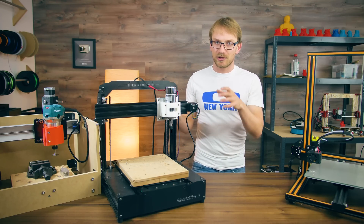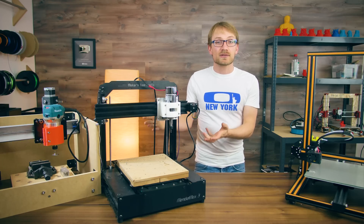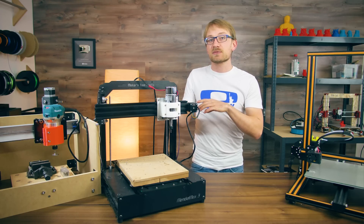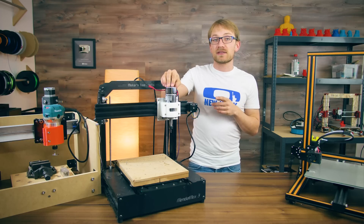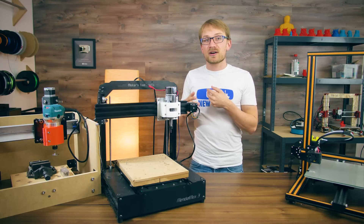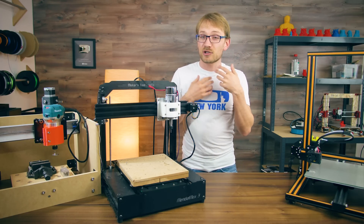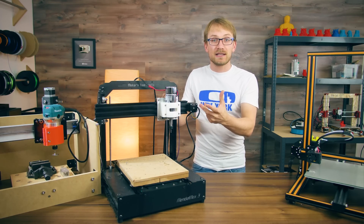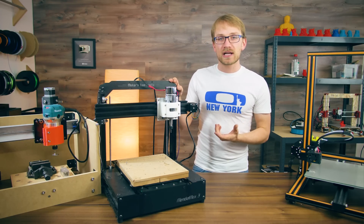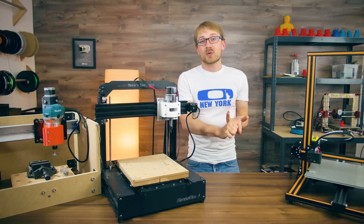Let's not forget that 3D printers originally did originate from larger CNC machines. G-code is directly carried over from that, and many early 3D printing developments were built to suit both CNC and 3D printing applications. What also carried over is that these machines are maybe not dumb, but at least blind — if a cutting tool breaks, the workpiece dislodges, or anything else happens, these machines often won't notice and will just keep going. That is just now getting better: bigger CNC machines are using load monitoring — the same thing trinamic drivers are doing on 3D printers — as well as servo motors with a feedback loop. So yes, 3D printers and CNC milling machines are actually quite similar, and knowing one well gives you a head start with the other. But the differences in machine construction — especially rigidity and top speed — don't really make combination machines viable for real applications. Maybe with a rigid frame and high-pitched lead screws you could build something that does both, but it would be neither a great 3D printer nor a great CNC mill.